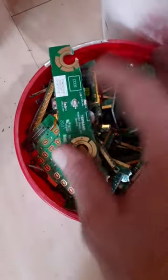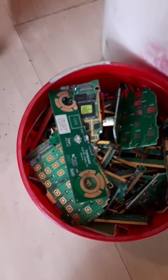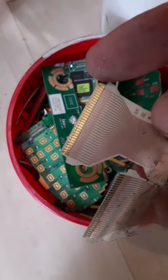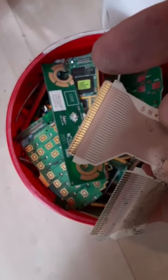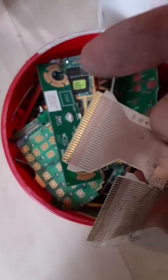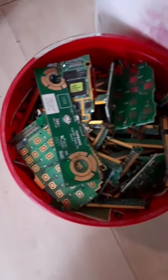Now, E-Nig gold is different than hard foil. That stuff comes off real easy. Basically, E-Nig gold is this stuff here, just so you guys know the difference. It's not the same hard gold foil that you would see. This stuff here is like an electroplate. It's a very thin gold, so you want to process it separately. You could process a lot of these and not get anything. You need a lot to get anything out of these. Okay? So boom, that's gold foils. That's one type of gold foil.